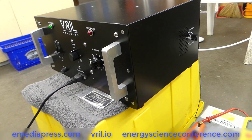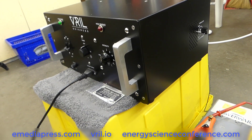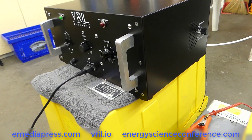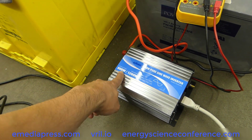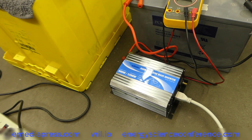The transformer is going to be about 270 watts, and then if you just throw in 5 watts for the fan and these little lights which are insignificant, you're looking at 275 watts max. If you round it to 300 watts and double that, that's what the inverter is rated for — 600 watt continuous and 1,200 watt peak — so you've got plenty of buffer and you're not going to be overloading this inverter.